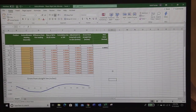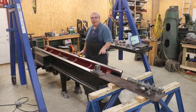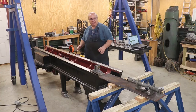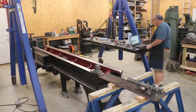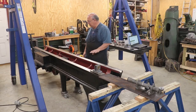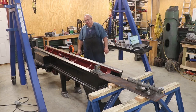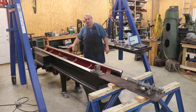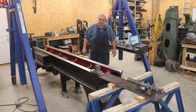I'll shoot the other one — I'm expecting similar results, but it should make a huge difference in overall flatness. Did the same setup here, just went to the other way, shot it from one end to the other. This time around it was 4.6 tenths. Before, it was 1.3 thou, and we went to 4.6 tenths. So again, huge improvement. I'm very happy, very confident that we got these things. This machine is ready to move on for the next stage of scraping — get the table scraped in and hopefully we can start really putting this machine back together. I'm really excited that we've finally got a big piece of this work done on this project.